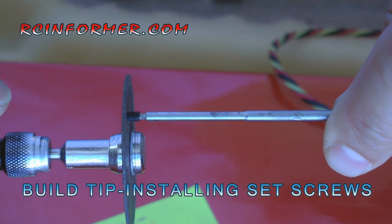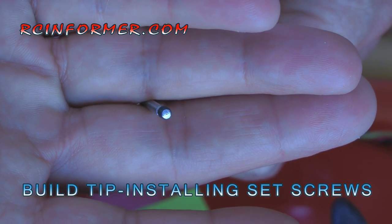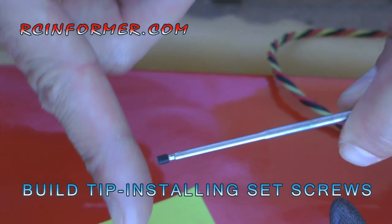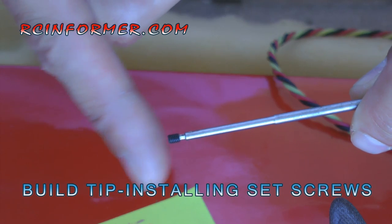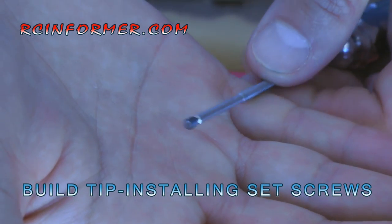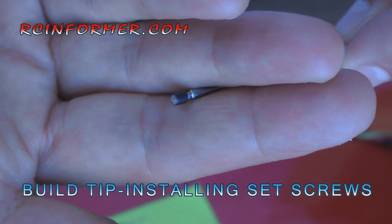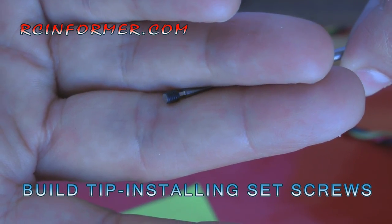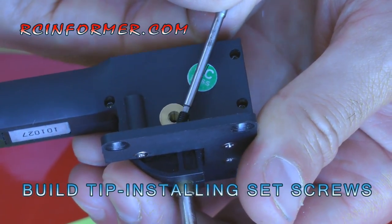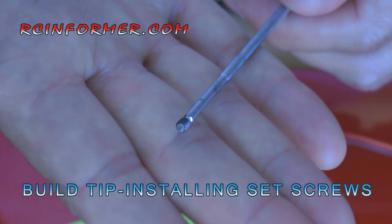What you're trying to do is get a very flat surface on the end. When you're done you'll have just a flat end on it. That flat end, when mounting a landing gear or steering arm, is going to actually touch against the flat spot on the shaft and keep it from rotating. One important thing to remember: when you file the flat spot on the end of the screw, make sure you file enough to have a sufficient flat surface, but don't file so much that you cut into the threads of the screw. If you file into the threads and put the screw back in the hole, you'll end up tearing up those threads. So be careful not to cut too deep.